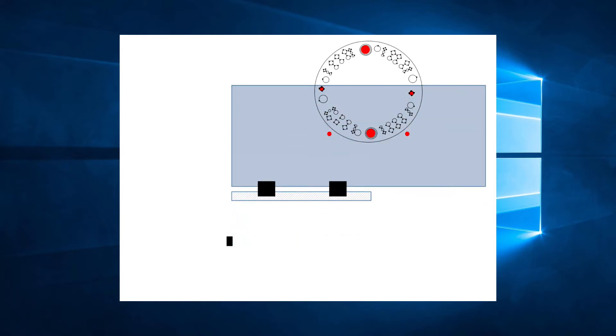Now let's say we need to punch another hole at X92, Y25. This will be a problem in the x-direction. To bring the point X92 under the striker, the sheet will have to move to the left, but the carriage is already at the limit it can move in that direction. The sheet can only be moved to the right, and X72 is the farthest point it can punch. Since we need to punch X92, we need 20 more inches of travel. This is a case where we will reposition the sheet.